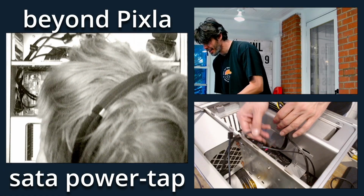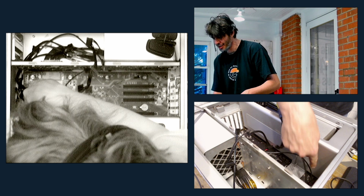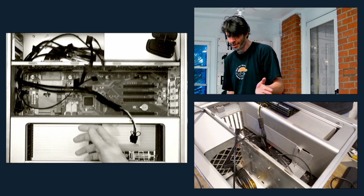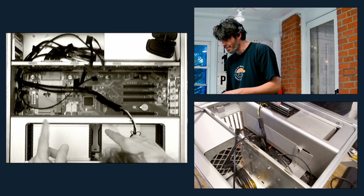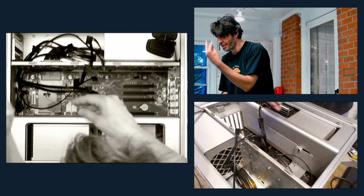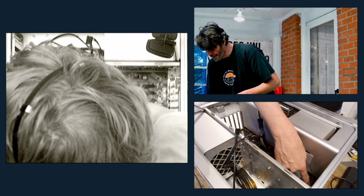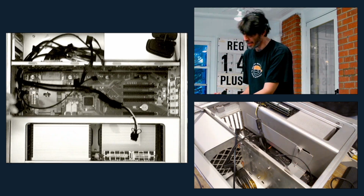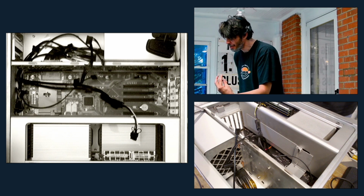I also wanted to get the power down into the lower chassis so I could run an SSD or this USB card like I was talking about, putting in the mini PCI slot. So I ended up ripping out all of the built-in SATA. It's one bundled cable from Apple. That's where I extracted the power, the 4-pin, where the opticals are powered from that bundle.